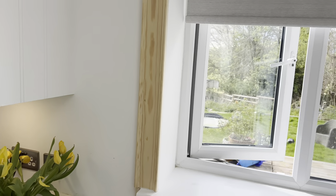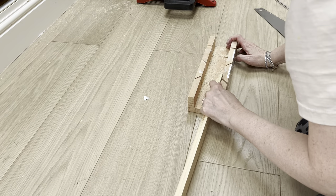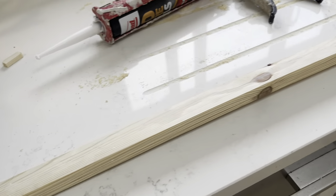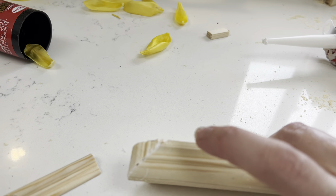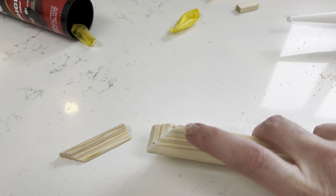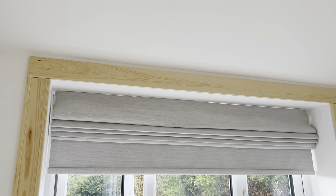The stripping really does make it look a lot better with this trim. Now I'm going to cut the bits on here and work out how to do this bit around the corner. To make a nice corner, I measured the length — it was 167 centimeters — and cut it at a 45-degree angle: front long, back short — that's how I remember it. I cut it across, then cut straight, and put that piece on the end so the end looks neat. I've done that on both ends. It's stuck on now so I'll let that dry, then pop it on the top.